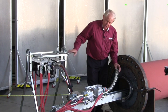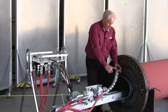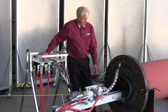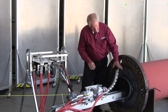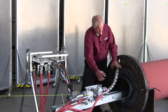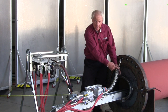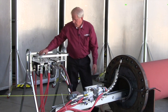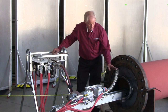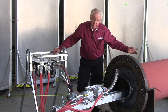The sequence of operations — rotating, translating, and feeding the hose — is very important. As you can easily understand, if the hose is in a tube and you go to move with the translator or rotator, the hose will get caught in a bind and could be damaged. So it's always important to make sure that the tool is in the elbow before moving when you're inside the drum.